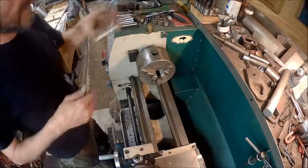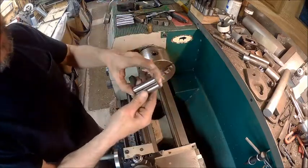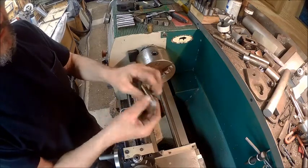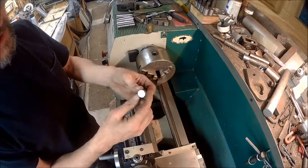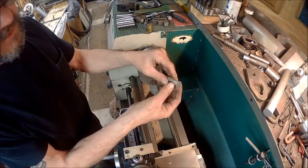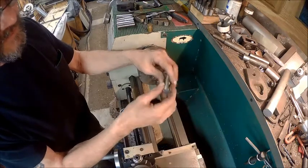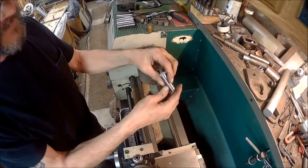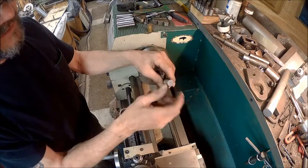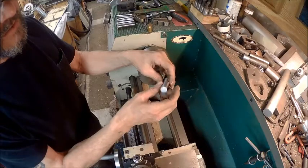Alright, so now we got them all to size, and now we're going to center drill both sides, and we're probably just going to do a little bit of a taper just so that it lines itself up correct, probably just a chamfer maybe, and it should be enough. And we're going to drill it and tap it for a quarter 20,